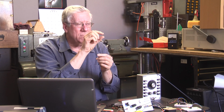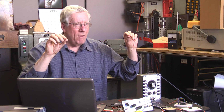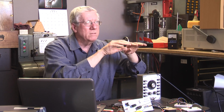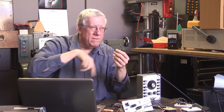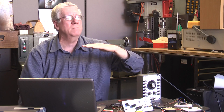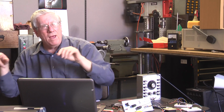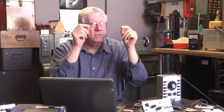And even if you could detect modulation, it would appear as what? Noise. Absolutely white noise. Now, on top of this signal, on the sending end, he modulates it with a voice or some source of information, but at a rate that's much, much lower than the wheel is spinning. Now, when you look at it, you see an overwhelmingly bright noise signature and a signal that is so far into the noise you can't possibly detect it. But when this receiver synchronizes to the exact same position as the transmitter of the wheel, you undo that noise so all you hear is the signal.